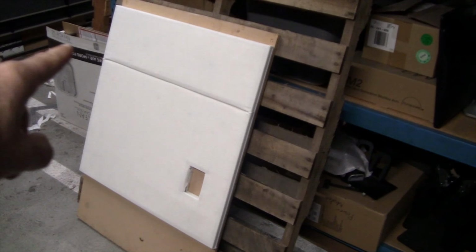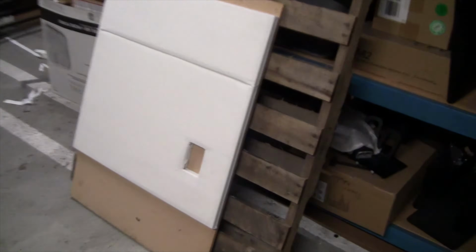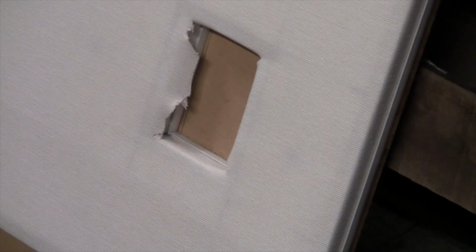But when you start introducing seams like this one here, or you're trying to put in an electrical outlet, let me show you a little detail on that. One of the things that I messed up here is I used the wrong piece of track. You can see that the frame product I used was what they call low level. I'm going to show you a couple of different frames on the next test sample piece, and how that is going to look better. This is the low level here on the perimeter, which is fine. When you do the seam piece, you have to use a different track, but I didn't do the corner properly, and I'll show you how I messed up there. See how you can see that right there? That doesn't look terrible, but I can make that look better, and I'll show you how in the next piece.